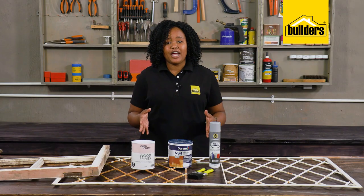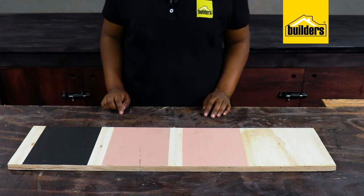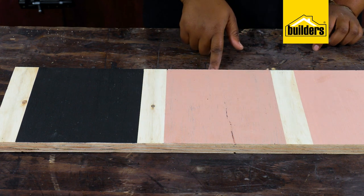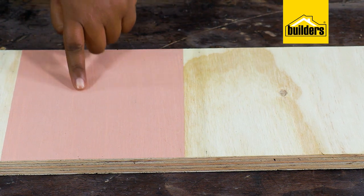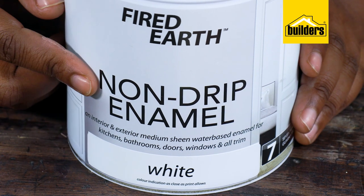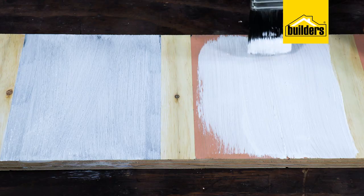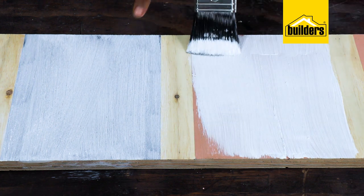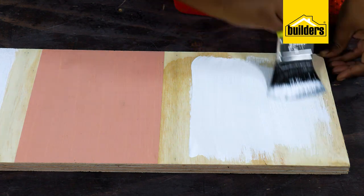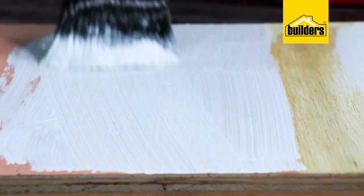This is more evident when trying to paint a lighter color over a dark color. Here I have a sheet of timber divided into four areas — these two being dark black, with one having had primer painted over it; the third and fourth are plain timber, with one having been painted with primer. I'll paint all of the areas with white fired earth enamel, a typical paint for timber. As I paint, you can see how the black is bleeding through the lighter paint, whereas the areas with primer are covering well. When painting the plain timber, you can see how the paint is absorbed versus the area with primer, which again is covered well. A second coat will finish off with the desired finish.